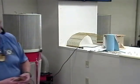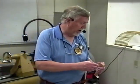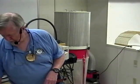So, well, this is my sander. It's a stick with a piece of sandpaper on it. And all I do after I've got all my segments cut, like that, takes care of it. And sometimes, depending on the wood and depending on how dull my blade is, that's another thing, sharp blade. Always have a sharp blade. Depending on how dull my blade is, I may have to knock off the corners, but I never have to adjust the angle. And that's really what we were trying to get away from, having to adjust the angle all the time to correct for errors in the sawing.